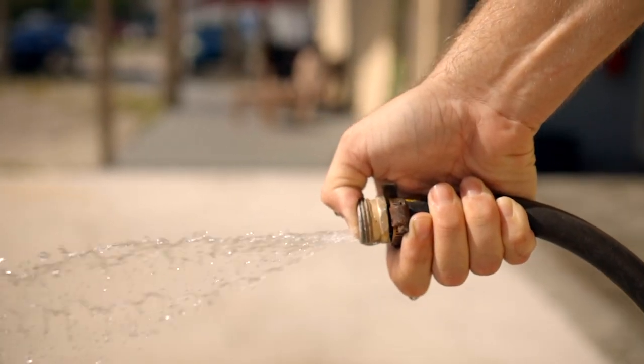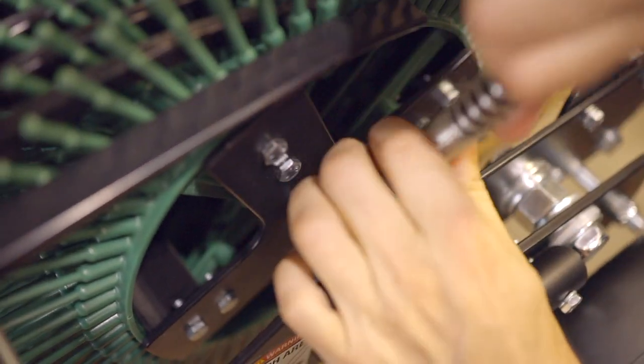Store the thing out of the sun, hose or blow it off when you're done harvesting. Periodically check that the nuts and bolts are tight and grease the four fittings on it periodically. There really isn't much to it. We try to design our harvesters so they're very simple to maintain, since most of our customers aren't full-time pecan growers and don't want maintenance headaches that come with carburetors, belts, oil, and whatnot.